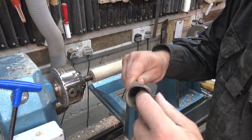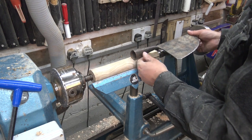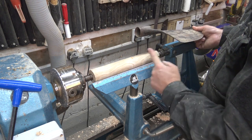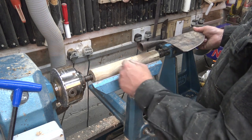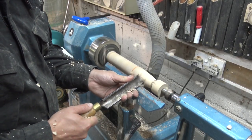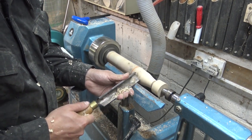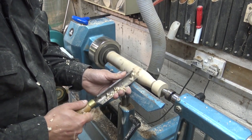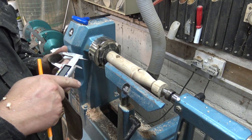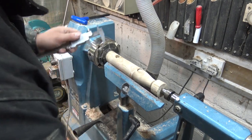Preparing for the meat cleaver now — this one has a socketed attachment rather than a tang. I'm going to lay out on my block of ash where it needs to go. I've got my taper marked out and I'm going to put a chuck-in point on this so I can test the taper and take it off between centers. I'm using a roughing gouge again to get the bulk of this out of the way — you can see me putting in that taper. I'll be measuring shortly with my calipers to make sure I get it down to the required size so the taper fits really accurately and holds on a bit like a Morse taper on the lathe — as it's driven onto the handle it'll be really tight.